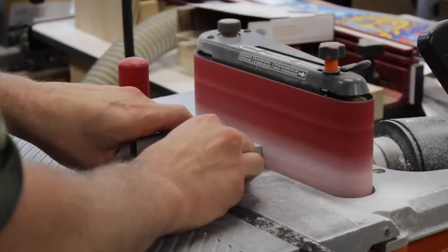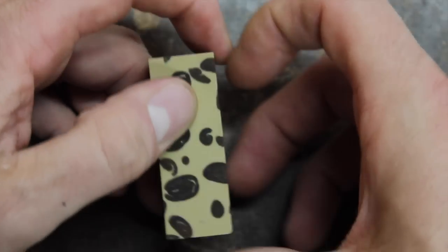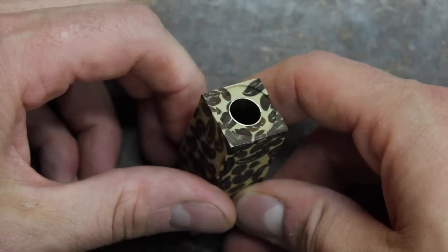Then barrel trimming. Now this is where something can go really wrong. So what I recommend is, after you have like a 1/2 inch of excess material after drilling, I would go and sand that after you glue the tubes in. Sand the blank down the ends and get it down to about a 1/16 of an inch past the tube on each end. Then use the barrel trimmer. But again, I would probably soak it a little bit. Try not to get the glue in the tube, but soak that end a little bit, let it dry, then take it to the barrel trimmer.